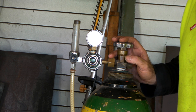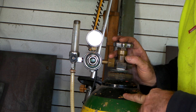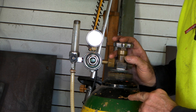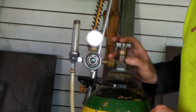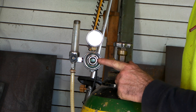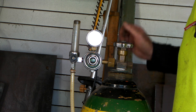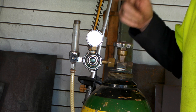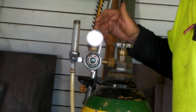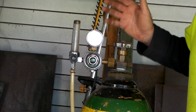In my country anyway, I changed my little bottle to a big bottle and it's much cheaper to fill. I also bought this bottle rather than renting it — you can rent these bottles if you want, but you tend to pay more for rental than what it costs to fill. I have a CO2 regulator here and it actually has a heater in it. The heater plugs into the back of my welder — it's a 36-volt heater — because CO2 comes out almost frozen from the MIG torch.